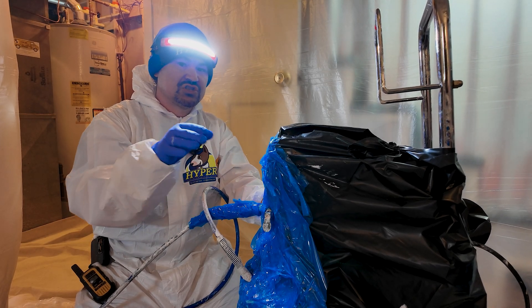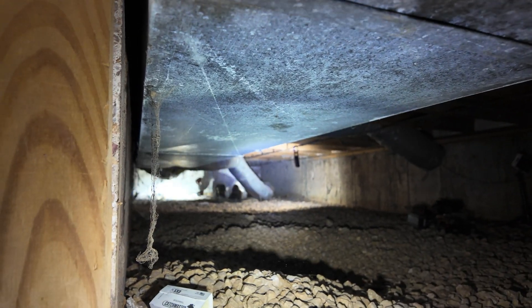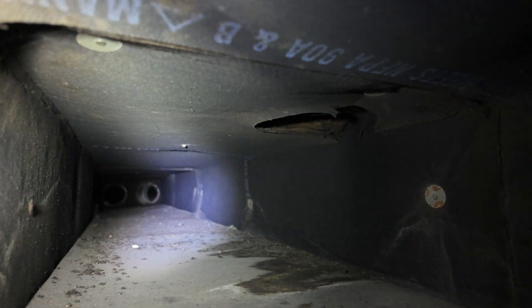If they skipped out on this process, there's a good chance that your air quality just got drastically worse. I'm out of the crawl space — Mike is still working in there repairing all these broken flex ducts. I want to show you the access point we made for our ceiling cleaning. Look inside the duct work here — you can see the mold spores on top of the insulation going all the way up to the second floor. The furnace is actually in the attic. If you ever run into a crawl space in a house, you should automatically know that encapsulation is going to be needed.